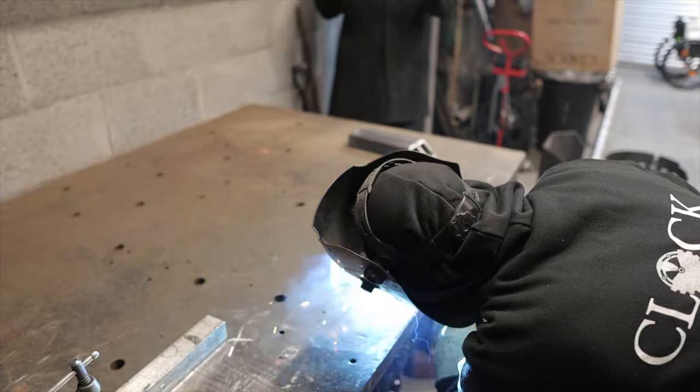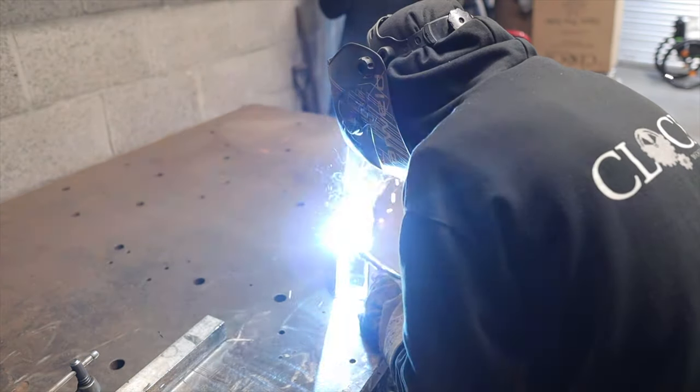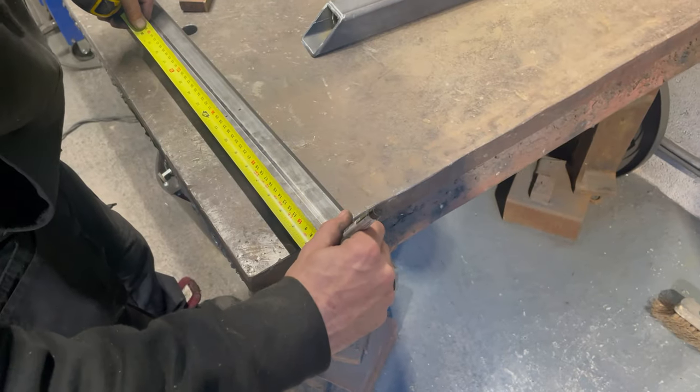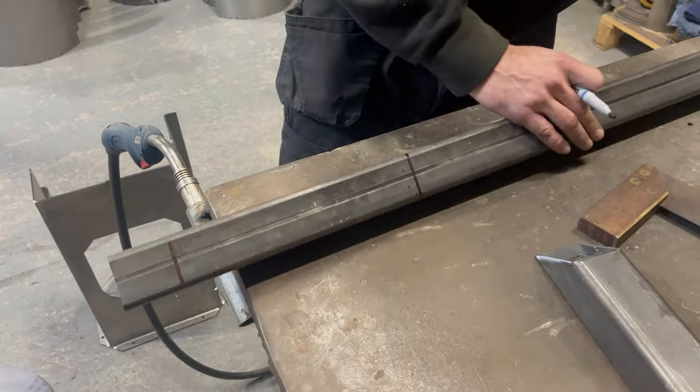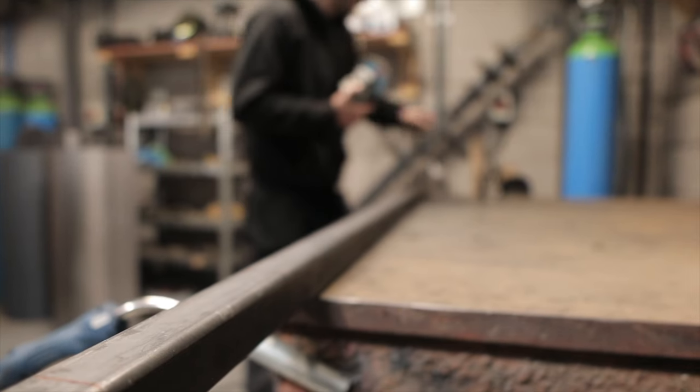So this is like the — would this be the secondary air coming in above the fire? Yes. So this is what keeps the glass clean? As you look at the front of the fire, there will be a couple of slots at the top, and your airflow is running through there with these in your pipes.